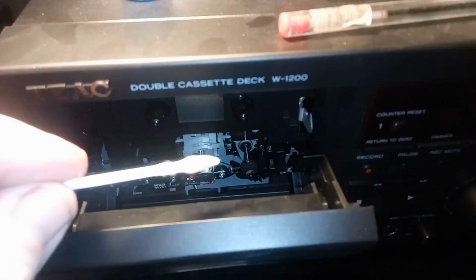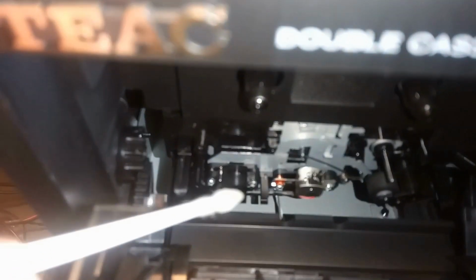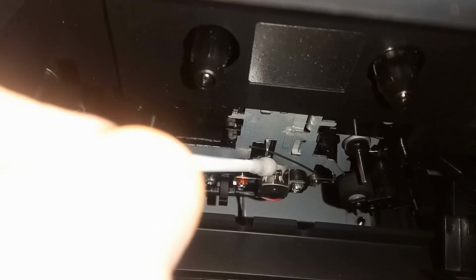This, to me, okay, it works for you if it floats your boat, but not very good, because after you've done the first wipe, if you've got particularly dirty heads, you'll then double dip in, you're making the isopropyl dirty, and you're then spreading it out. So instead of having clean heads, you're getting heads with a very microscopic edge. Having got my wet cotton bud, Q-tip, whatever you want to call it, I can now look down here, and it's quite simple. Just squeeze it across, just make sure it's clean, and the same with the other one.